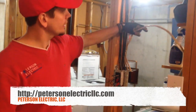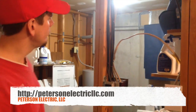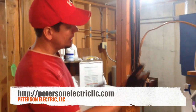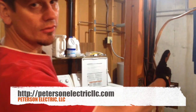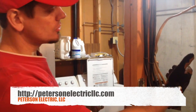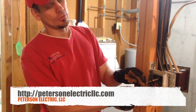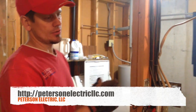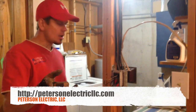Now these circuits serve different things. For example, this white one right here is just 120 volts — it does my lighting. These black ones coming down, which is a 1980 style home, it's now a yellow color jacket, but it's a 12-2 Romex NM non-metallic jacket conductor cable system. This right here is going to be 240 volts. And at 240 volts, the difference between these two is just the potential of the voltage.